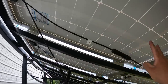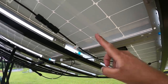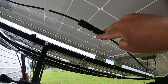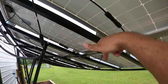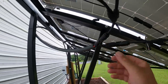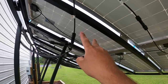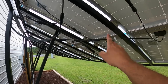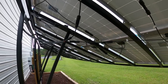Let me show you what we did. I've got four panels to work with. We hooked a positive and negative from two separate panels together — that's seriesing — so our voltage went up to 48 volts because these are 24-volt panels. I did the same on the other pair, so I now have two sets at 48 volts. Then I took the negative from one set and the negative from another, put them on a combiner and ran that into the shop, and did the same with the positives. That's paralleling what's left, which increases our amperage to 10 amps since these are 5-amp panels. So now we have 48 volts going into the shop at 10 amps.